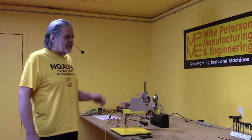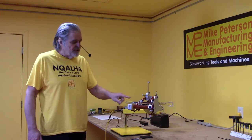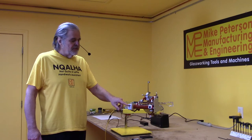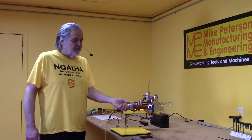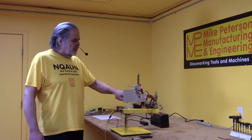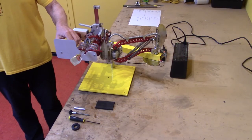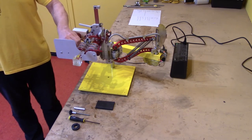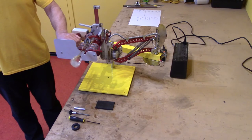The Inquala is designed for very quick and easy placement of a glass piece, so you can take it out, do some handwork, put it back in, and return to operation. The Inquala has two operating modes, selected by the little toggle switch on the controller box. When the switch is in the up position, the Inquala is in rotation mode. When the switch is in the down position, the Inquala is in positioning mode. In rotation mode, pushing the front button starts and stops rotation. Using the thumb wheel increases or decreases speed — it can go really, really slow or really, really fast.